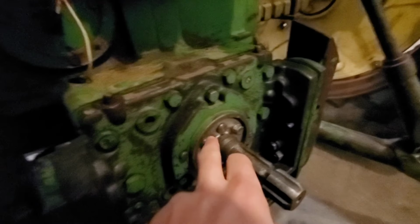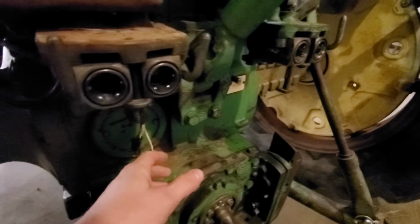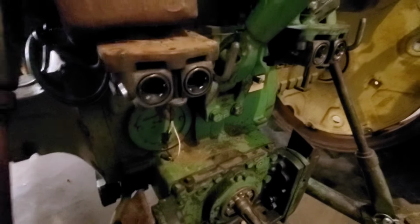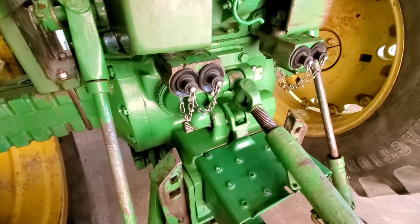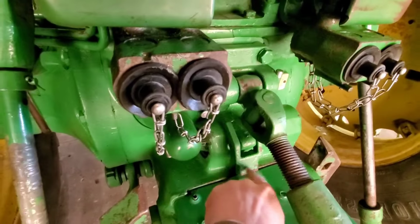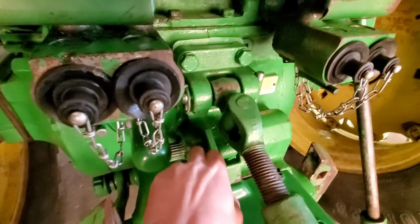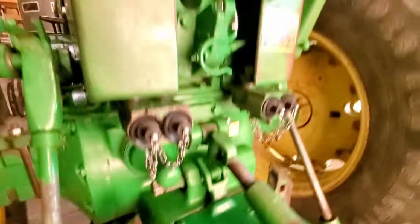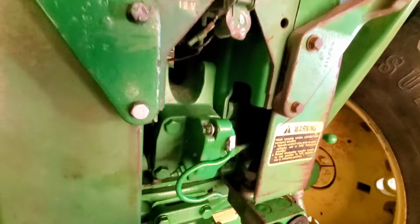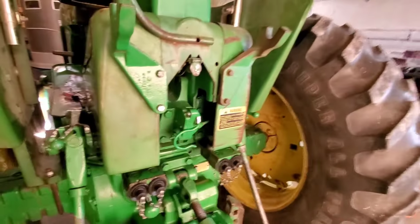That holds the PTO shaft, and you can notice that the stub shafts are splined on there, whereas on a 4020, this was all cast different. I'll show you here, which held the additional shaft on the tractor. Now here's the 4020. You can see it's got the different style clip that holds the PTO shield. You have the spare PTO holder there, and then you have the snap ring in PTO, different hydraulic boxes, and again, this unit here is different, and the top 3-point link is different.